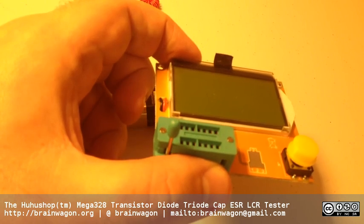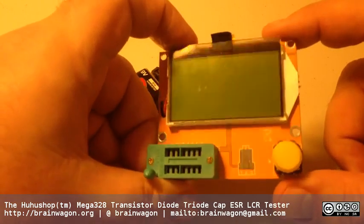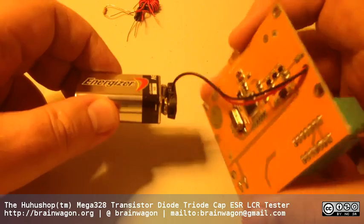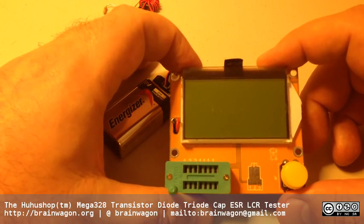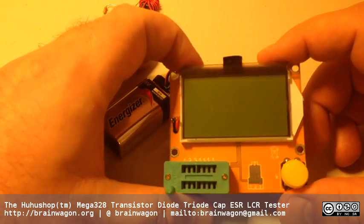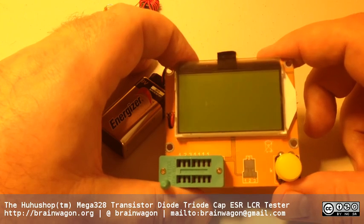Good reminder - I actually had some 2N2222s that had weird pinouts compared to the normal data sheet, which is the kind of thing this solves. This area can also be used to put little surface mount parts on if you wanted. It's also good for measuring diodes - it measures the voltage drop across diodes, useful if you're making a mixer where you need to match a couple of diodes. You can also use it on LEDs to figure out what the anode and cathode are.